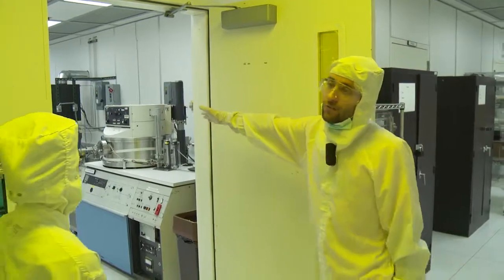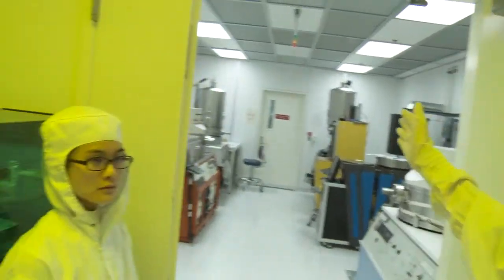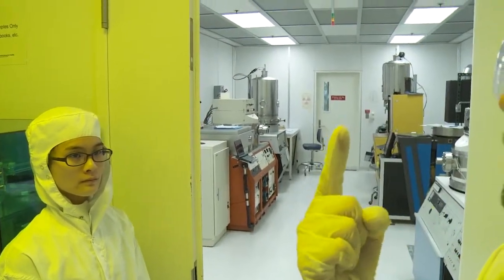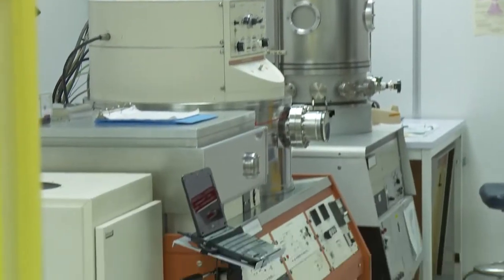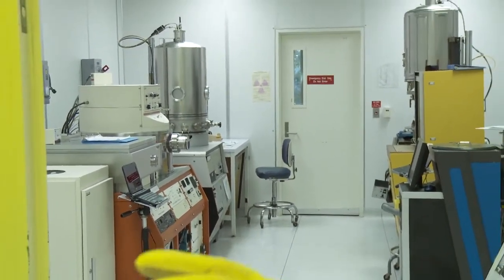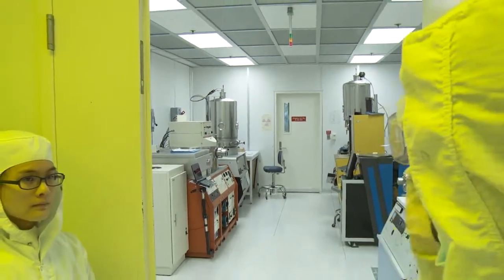But there's more, like there's another etcher, a plasma etcher. Instead of being deep, that one is called a reactive ion etcher. So that only does one step. Do you remember that the other one was depositing and then etching? That one only does etch. And what it does is like an isotropic etch, so it more or less etches in all directions. For certain things, it's good enough.